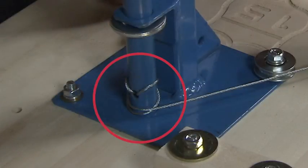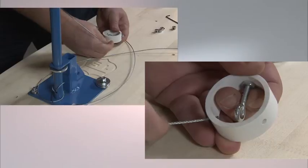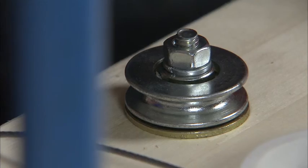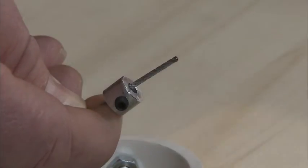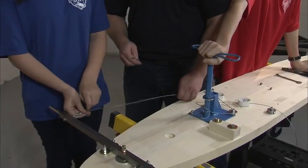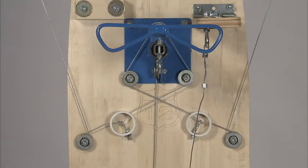Now thread one cable around the steering pulley located on the brake steering mount. Then thread this cable through the outside of one of the two remaining holes in the cable adjuster and into the inside of the cable adjuster. Pass the end of the cable through the eye bolt and inside the adjuster, then thread the cable through the remaining hole in the cable adjuster. After you've done that, thread one cable around the cable pulley located on the floorboard from the front of the pulley around over the cable, which is going to keep the tensioners down towards the floorboard, and slide two quarter inch cable clamps on the cable end. Thread the cable through the front axle eye bolt assembly and insert the loose end of the cable back through both cable clamps. Pull the cables tight and use a 5/64th Allen wrench to tighten both cable clamps. You can place these clamps right next to each other with no space in between or leave a little space. Repeat that process for the other cable, but be sure to check your plan book to make sure that your cable routing is the right way for the model car that you have.